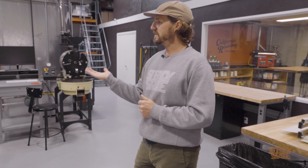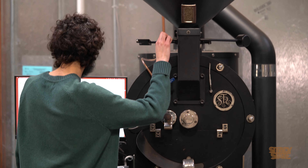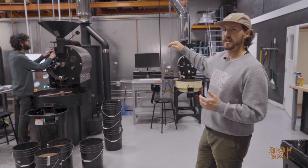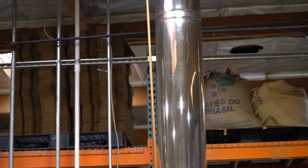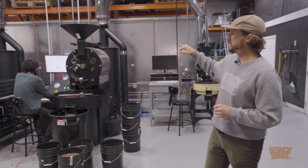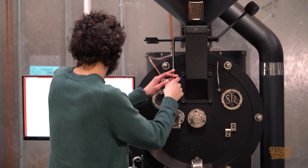The next one we have — we can see Portal Coffee roasting here — is an SF25. It can do up to 25 pounds at a time. The big thing in the back is an afterburner which runs at about 1,300 degrees and incinerates all the smoke before it goes out into the atmosphere. We've also plumbed in fire suppression on all of the roasters that are 25 pounds and bigger, which is super important.